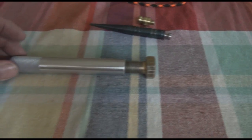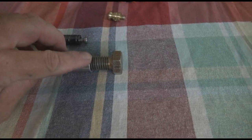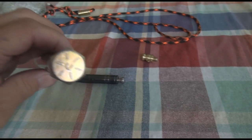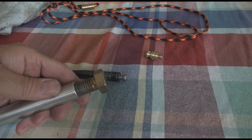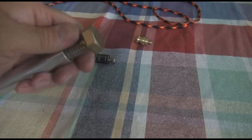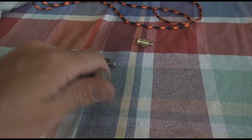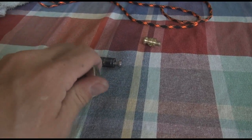Here's an update. This is kind of the container that all this is going to go into — it's a little short so I'm going to put a brass cap on it. You might be wondering what this great big grade 8 bolt is doing in there. I could find a tap but couldn't find a die locally, so what I'm doing is I took this bolt and tapped this out with a 5/8 thread national coarse — so it's a 5/8-11 — and I hollowed this bolt out.